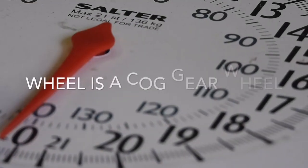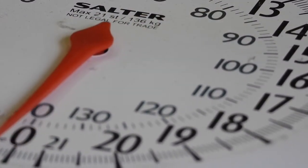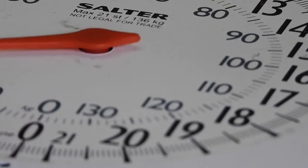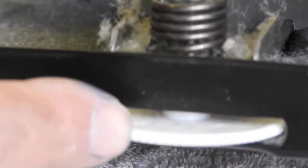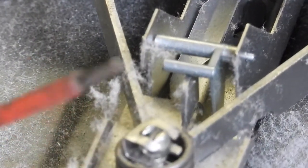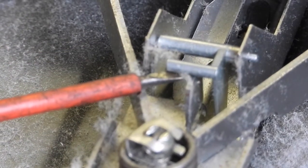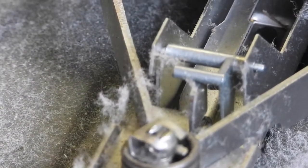And that arm is connected up through there to the wheel, and on top of the wheel there is the gauge. So if I move this little lever — which I just showed — that's doing that. When you stand on the scale, up it goes. This little adjusting wheel is just moving this plate up and down, which lifts this up and down, and that's what zeros the scale indicator.